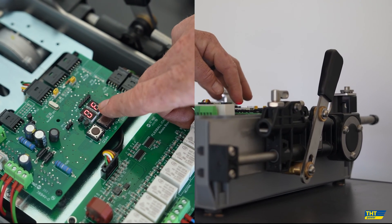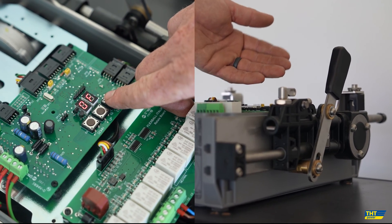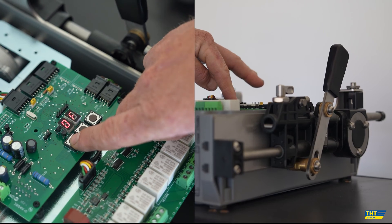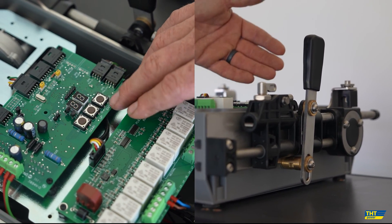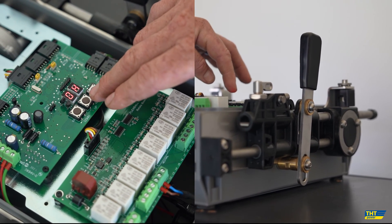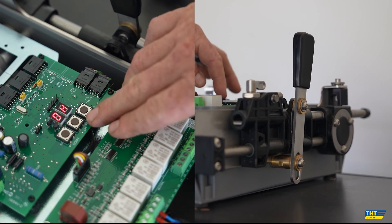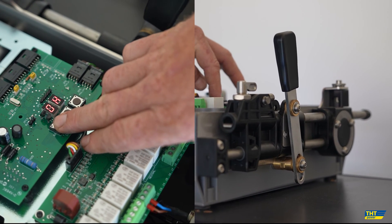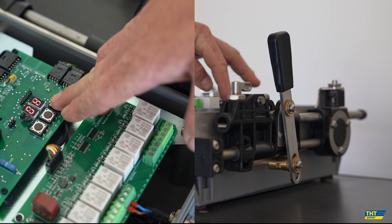Again up to the next one — 'OF'. This represents gearbox neutral. We press enter to make it flash, then adjust using the up and down buttons to wherever the lever sits. Once you are happy to the millimetre, press enter to save. Then we press up again to the last one — 'OH', which is gearbox forward. We press enter again and move using the two buttons until we get the gearbox to the right position, exactly falling into the forward detent, then enter to save. That is all five parameters set.